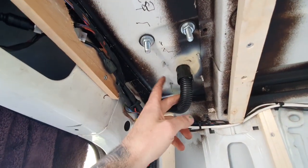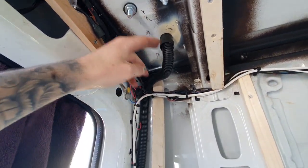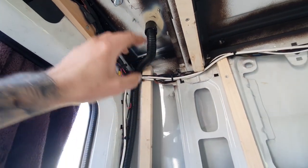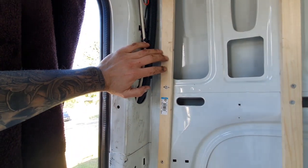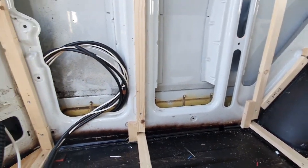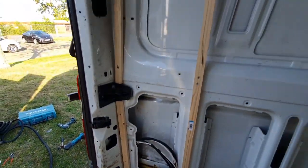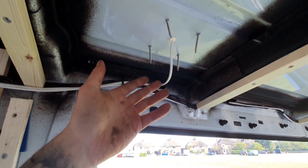The copex is flexible conduit — I thought this was a good idea because in future if I decide to put anything else in I can, and it means I can clad it, get it insulated, and run all my cables in later. I haven't got the solar panels and lights as yet so I can do it later. It runs down the side here, all of this is going to get boxed in — it comes down here and my battery bank is going to sit along here. The front one just has a bit of two-core flex for that one light.